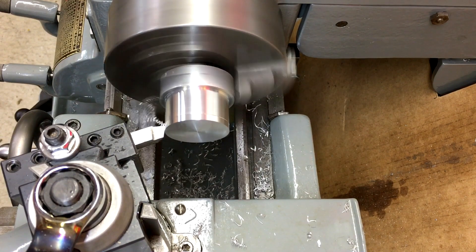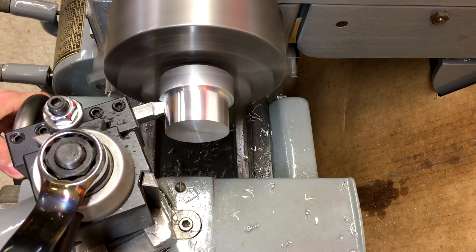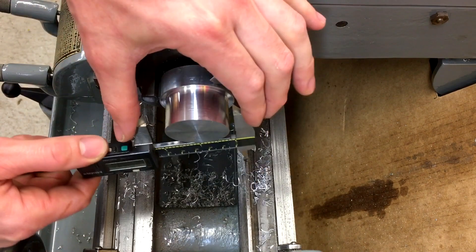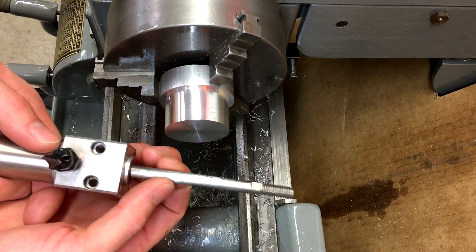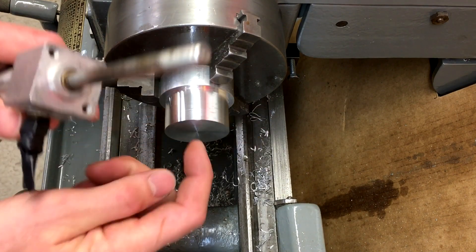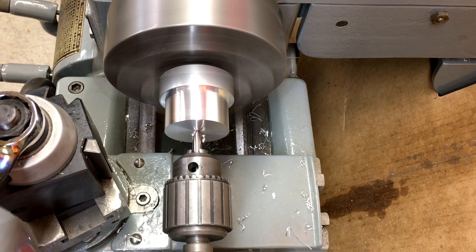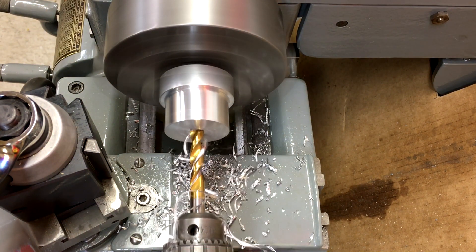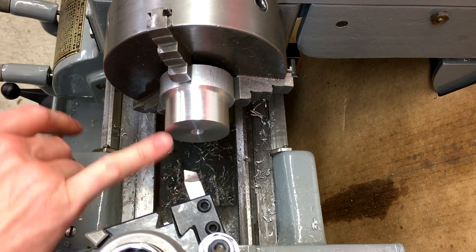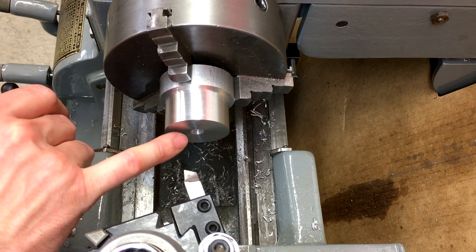This should be the final pass. While it's facing this way in the lathe I'm going to drill a clearance hole — I think it's going to be 3/8 for this 5/16 shaft — and also turn a register in the face to seat this. I've got this tool lifted a little bit above center height so hopefully it'll clear on the bottom, and I'm just going to do this by hand feed a little bit at a time and measure it. We need a three-quarter register on here.